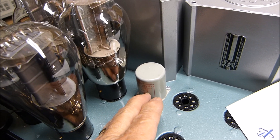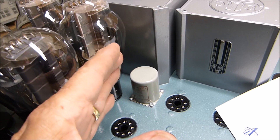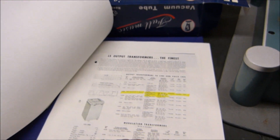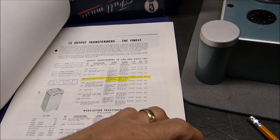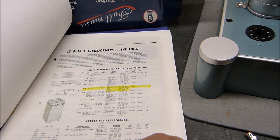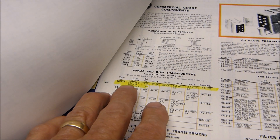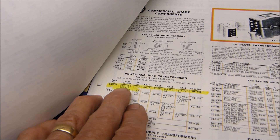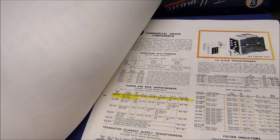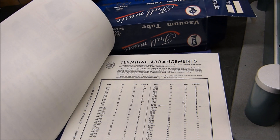You can put this choke across the cathodes of the driver tubes to drive the grids of these tubes. I've got all the data on this — it's taken me most of the day just to collect it. Everything arrived today and I've been playing with it. The power transformer is right there: 435 volts each side of the center tap, or 365 volts — it's got another winding at 125 volts each side of the center tap, plus a bunch of filament windings.